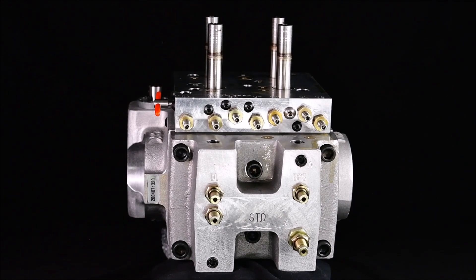First thing you'll want to do is verify that you have the correct valve. On the UC4M the jack is on the left hand side. On the UC4 valve the jack is on the right hand side. The M stands for mirror image, so on a UC4 and 4M the jack and the tank trade places.